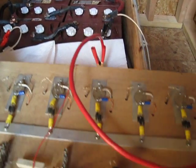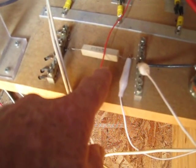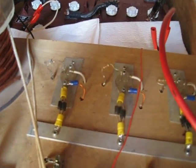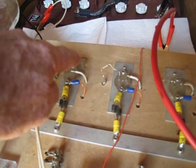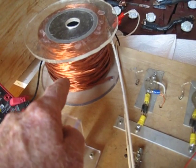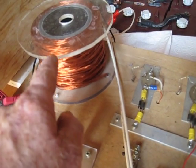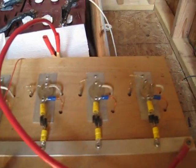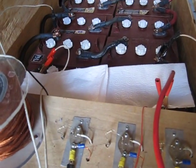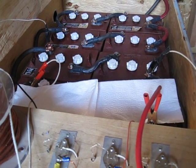While I was doing yard work, this has been running. You have a potentiometer here, there's an inline resistor — it's 100 ohms — and then you have five transistors with 33-ohm resistors, a little on/off switch, and a little homemade coil. There are six wraps of number 18 magnet wire, all of them 100 feet long. One of those wires is what's called the trigger circuitry, which runs this part right here.